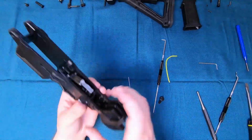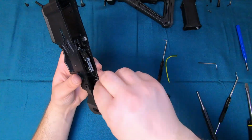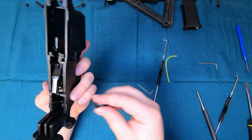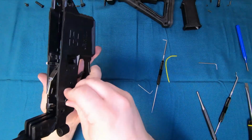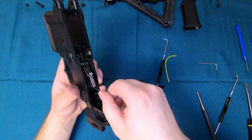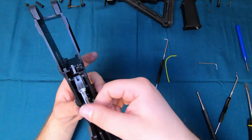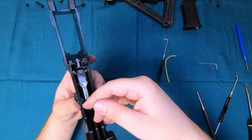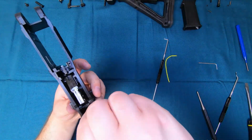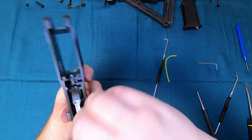And of course, don't forget, before you can put in the other half, you need to unscrew the grub screw on the right side. That probably should be far enough. Nope, just a little bit more. Make sure these are facing the same direction. You don't want to make a mistake on that. Okay, and there is no bottom to the grub screw, so just kind of eyeball it. Make sure that's not sticking out the other side. Yeah, actually just a little bit more. Okay, I think that looks good.